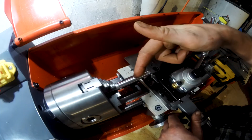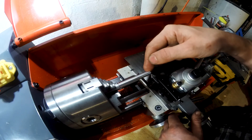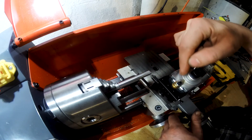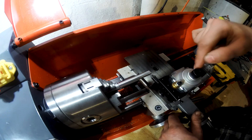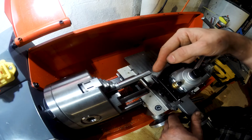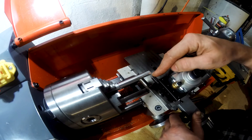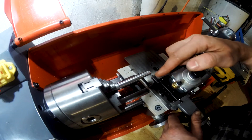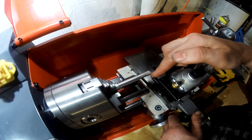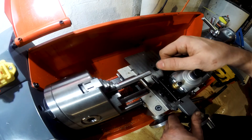Our shaft here is 10 millimeters in diameter. Our shaft here on the handle is 7.65, so I want to neck the end of this down to 7.65 so whenever it bolts up against this it's flush against the top, just like the original one is. The first thing I'm going to do is surface off the face of it, bring it back, touch off on the corner and reset my zero, then go ahead and start pushing in a total of 2.35 millimeters to get my 7.65 diameter.